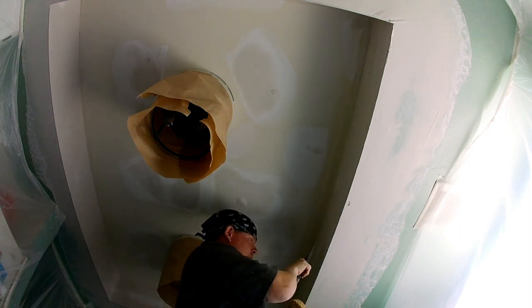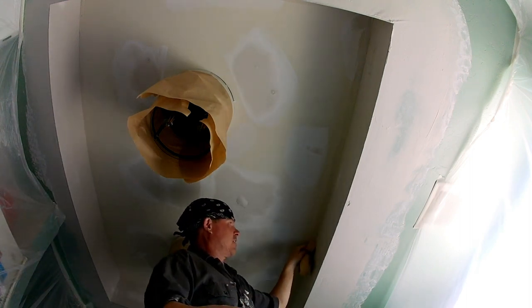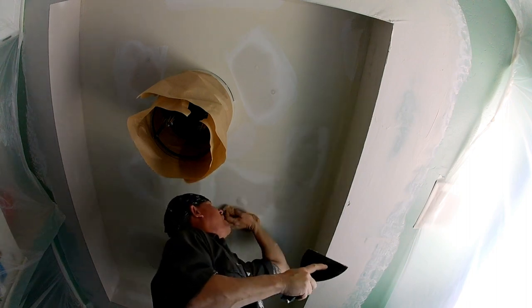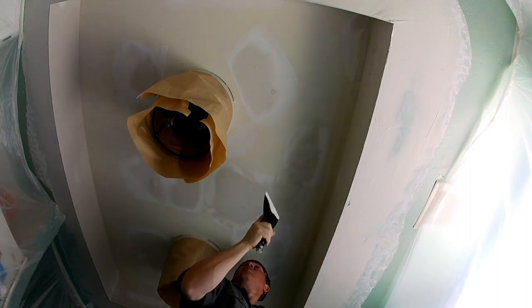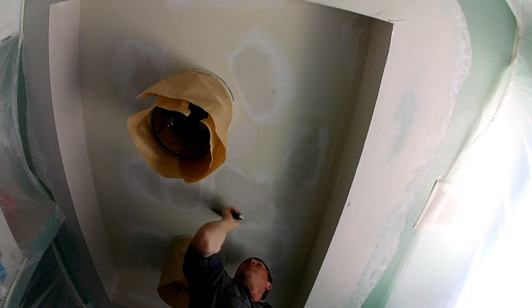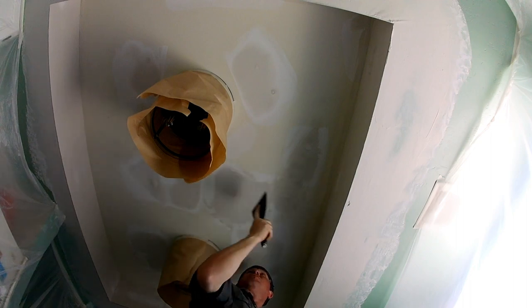With joint compounds you let dry overnight, then you sand them and then recoat it. With a hot mud, this is more professional grade material. You work it as it sets up. They also do muds like this for cement work,